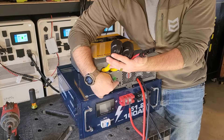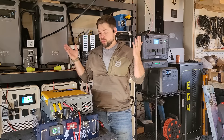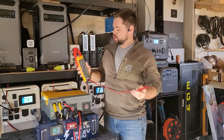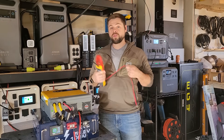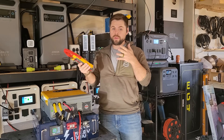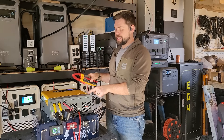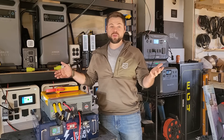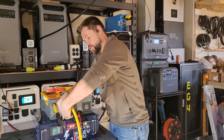Then on the bottom of the inverter is the on switch. Now we have a fully functioning DIY power station. Let's make sure we're getting 120-volt power out of this — set the meter to volts AC: 120 volts and 50 hertz. These inverters stay at 50 hertz until you plug something in, so let's plug something in and make sure it's fine. That's where this adapter comes in, which gives me multiple outlets — basically a power strip.